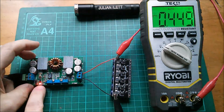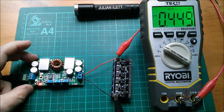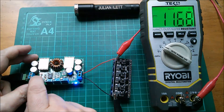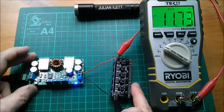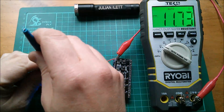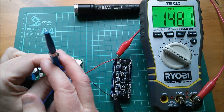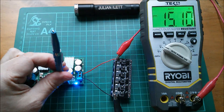Now it won't charge at the moment because the switch is off — I've got my little red fault light on. Let's switch on. Oh wow, up it goes: 5, 6, 7, 8, 9, 10, 11 — should settle around 12 volts. That charged pretty quickly, which isn't surprising since these are only 10 farads each and this is probably set for over 2 amps. Now I can start inching this voltage pot up. I've got virtually real-time response if I do it slowly, so I'm going to take it up to about 15 volts. There's no point risking one capacitor going over-voltage, so we'll stop there.